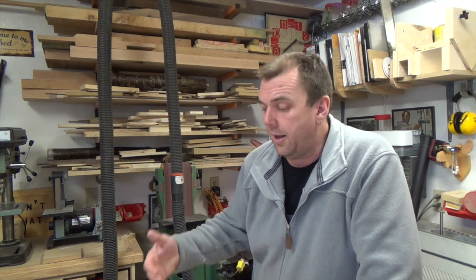Be sure to check your angles. If you're not sure, cut test pieces. If you're doing a larger piece of furniture and you don't want to do test pieces because it's a 4x8 sheet of plywood, we talked about scale. Scale it down. Instead of a foot, make it an inch and make a smaller version of the test cut with those angles that you could piece together on your bench top, and be sure that it's going to fit right when you cut the actual parts.